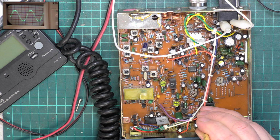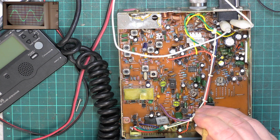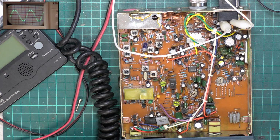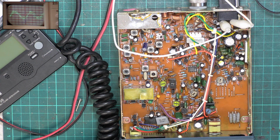Now the peak needs to be as symmetrical as possible. We can have it to a peak to the left here, and it goes lopsided. So we actually want the peak that is as symmetrical as possible on that sine wave, because there is a further peak with it being lopsided, so I just thought I'd mention that. So that's actually quite an improvement. It's receiving very well, and I can tell you now that it's 0.35 for 12 decibel SINAD, but we'll come to that.